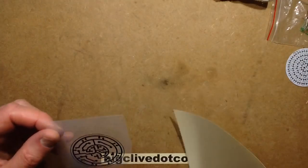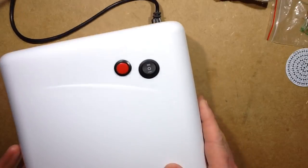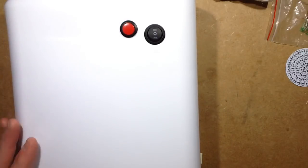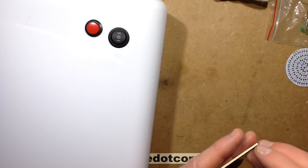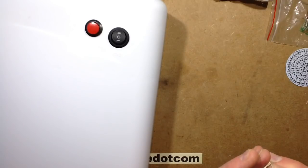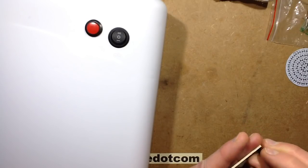So what I'm going to do now, I'm going to do it in the trash style. I could crack out my huge expensive tubes and lid ultraviolet unit, or I could use this nail varnish curing device. I'm going to use the nail varnish curing device because it's a small circuit board and I do want to try this out. So I've got my laminate here, and I'm going to have to experiment with times. I can't remember if it exposed properly in 1 minute or not last time.